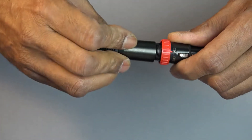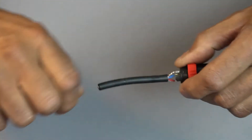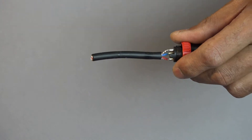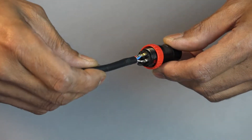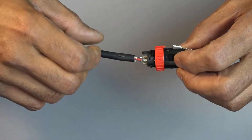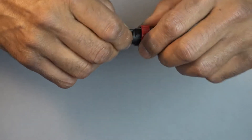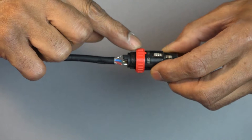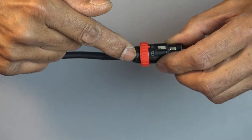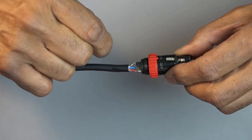This one seemed to be faulty — it's the only one I've ever had that's been faulty, and I use them a lot. It could be me. You simply wire it like a normal XLR; make sure you get it correct. This bit kind of comes out somehow, and you can see in there there's gold contacts which short pins two and three, which cancels out the sound.